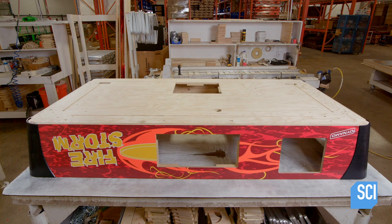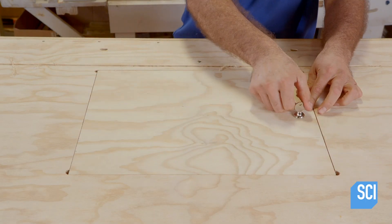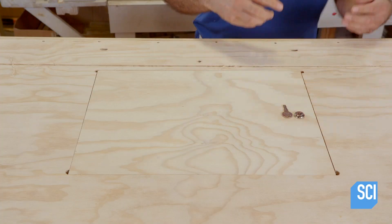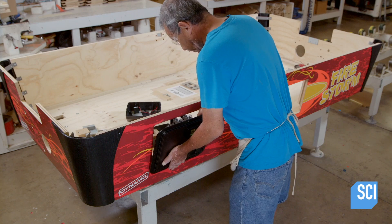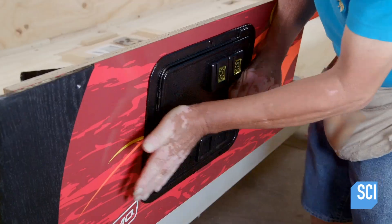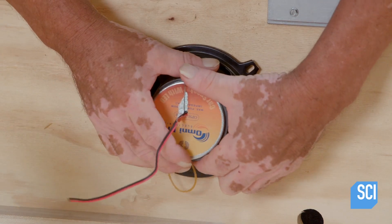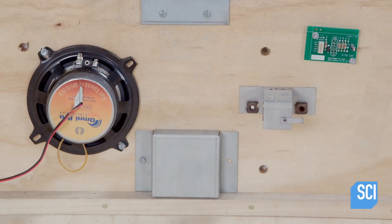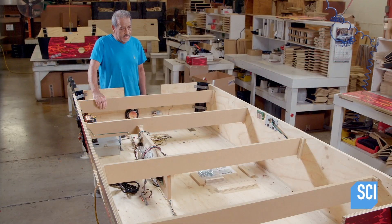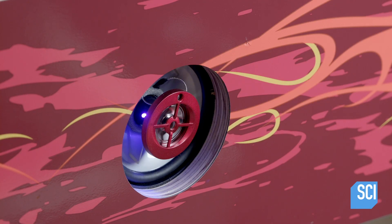A locked door is installed in the plywood floor, which will serve as an interior storage compartment. Next, a craftsman installs the coin door and secures it into place. He mounts wire speakers that project sound effects to a computerized optical system that tracks the puck's movements. Once the structure is fitted with wooden panels, the game's flashing lights and sensor activators are installed.